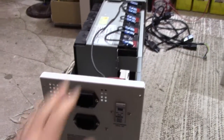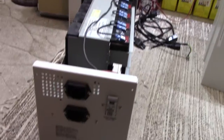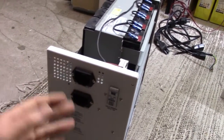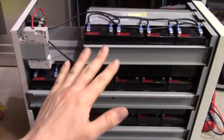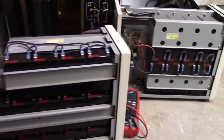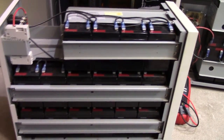This one is just at 0V or 0.2V or something ridiculous like that. Clearly at least one of the cells have gone entirely open circuit. And I'm happy for that, since if these were connected together when I got them, all of these batteries would have been entirely empty, as would all of these. They are from 2005, so I don't think they're any good anymore in any way, shape or form.